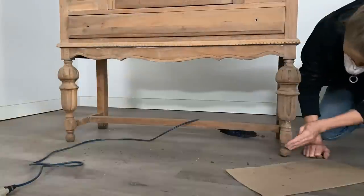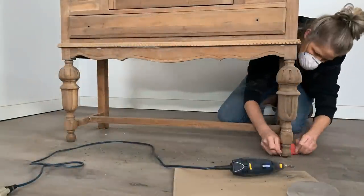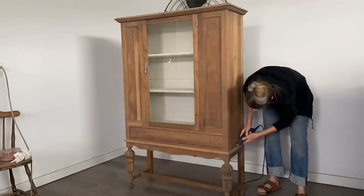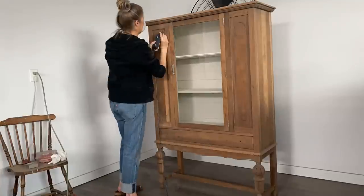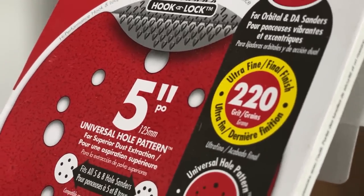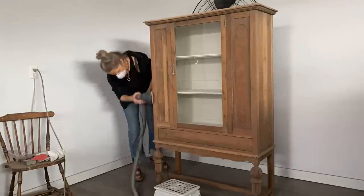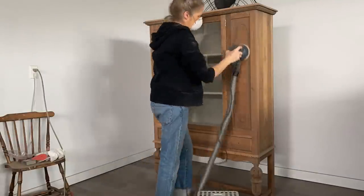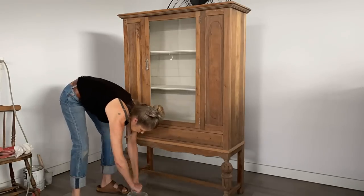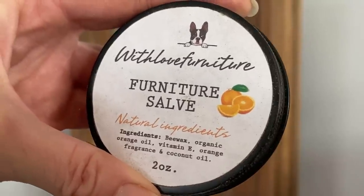Going back to the rotary tool, the Dremel, and just going around doing a little bit more detailed sanding just to get into those little crevices — it can be a bit of a patience tester, but for the overall end result it's totally worth it. I'm going to go around with 220 grit, a very fine sandpaper, just to help smooth out the surfaces after what the 60 grit did, so it's a lot softer to the touch. Then I'll finalize by cleaning the piece using a microfiber cloth with warm water and a little bit of vinegar just to get any sanding residue off the wood. Once completely dry, I'll use furniture seal to seal the entire wood project.